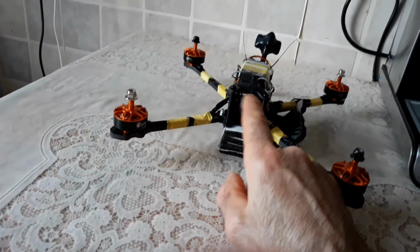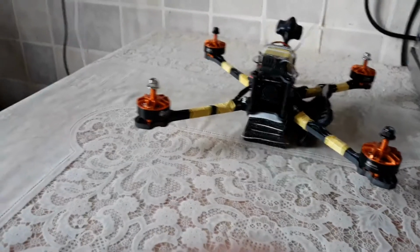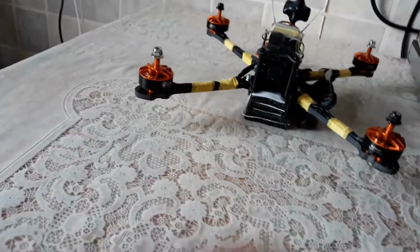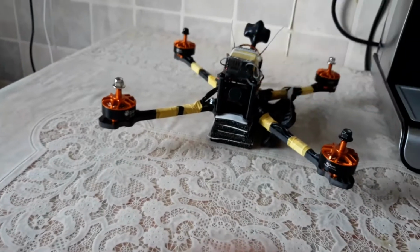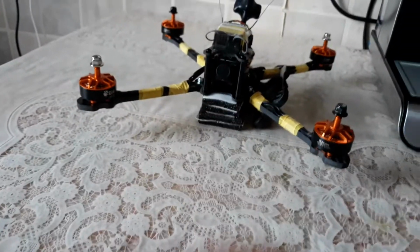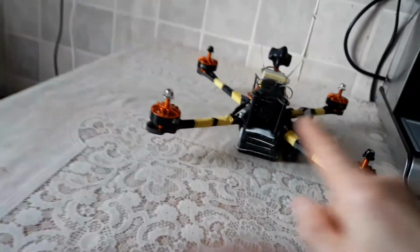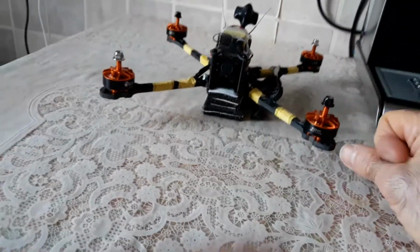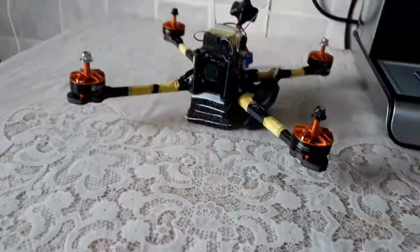The only problem, the 5 pins: there was a 5 pin cable inside, and this camera is 3 pin, 2 pins, so I had to find a way to change that. I had to swap pins with another connector. Otherwise it couldn't work. So I pulled the pins out of whatever was inside the cable, put my own connector inside, refixed it, and put it back to this one. On YouTube, many have a 5 pin cable on the camera and a 5 pin cable inside the board. A bit disappointing for me. Mine didn't come like this, unfortunately. Luckily, I knew how to sort out this problem.